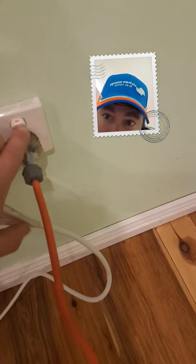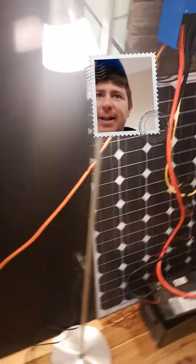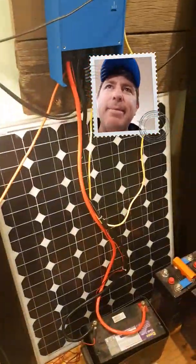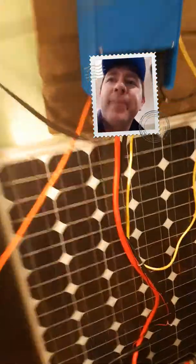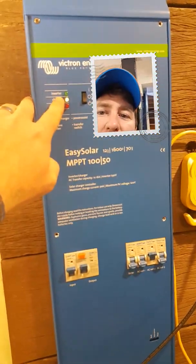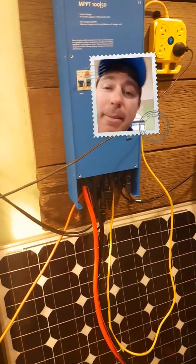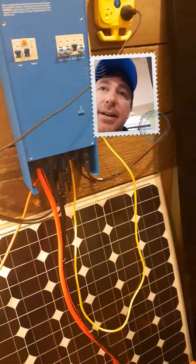So you just plug your batteries in. Now the next thing here is an extension cord — I'm in Sydney in my house here, so I've just plugged it into the wall. What we'll notice, there's a shelf there — it's actually an old suitcase we've repurposed that we're making a shelf out of, which is great. My handyman made that for me. So this 240 comes back in over here. We're still on inverter at the moment, and it's just popped over to charger. The solar panels are inside so they're not working, not charging the batteries. Because I've turned that on now, it's actually grabbing power from the house and charging the battery up.